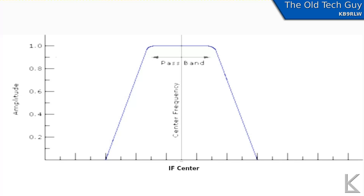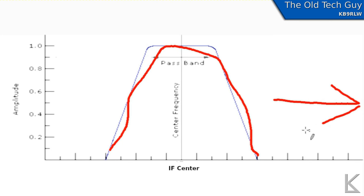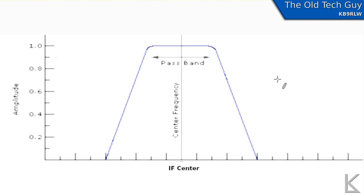This is a graphic illustration of your basic passband or bandpass filter in a modern receiver. This would be the center IF frequency here in the IF chain of the radio. All of the signals that you have coming in are going to be in the IF, and this filter is there to prevent signals out here from interfering with signals that you're interested in. Only things that fit within the envelope of this passband filter will get through to the detector stage at the far end of the chain.